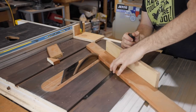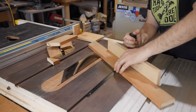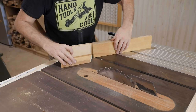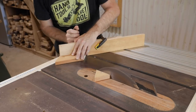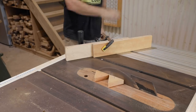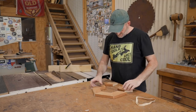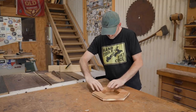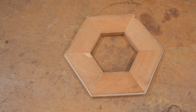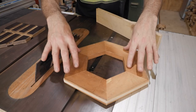The guide does need checking for accuracy. I'm checking the 60 degree angle first by cutting six pieces — I cut all the angles on one side, then flip them over and cut the angle on the opposite side. Make the pieces a bit longer than I have here if you're concerned about getting too close to the blade. I was very surprised — they came out just about perfect. I did expect to do some adjustments, and that's probably something you'll have to do, but it's easy enough and I'll show you how.